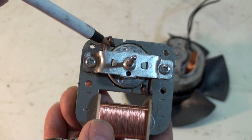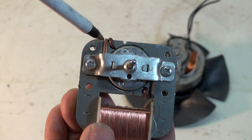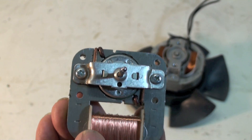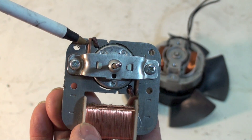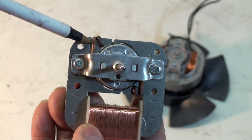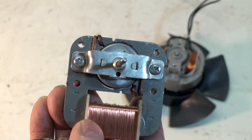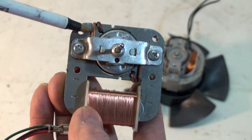When we put this shading element in here, there's a little bit of power induced into it and it puts things a little bit out of phase — it just kind of throws it a little ways. And once it throws it, it'll start. If you did not have this on here, this motor would not start. But if I flipped it like that, it would start. So it's a starting circuit for this very simple motor.